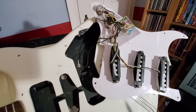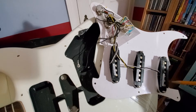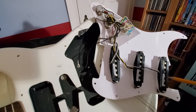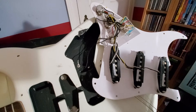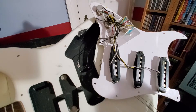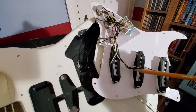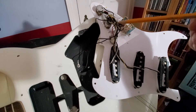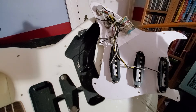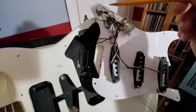So first thing you can see as you look at the pickups — you've got three pickups and they are ceramic magnet pickups. They have ceramic bar magnets underneath the base of the pickup and metal pole pieces going up through the middle. Those steel pole pieces guide the magnetic field of these magnets up toward the strings, which makes a more sensitive pickup. Each pickup has a positive and negative wire coming out, going up toward this five-way switch.